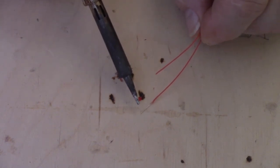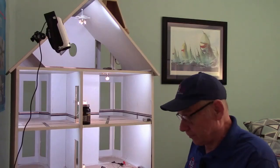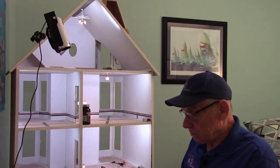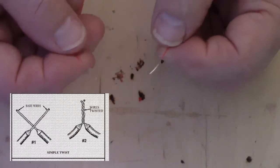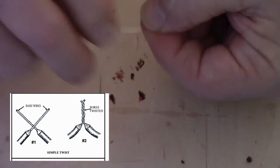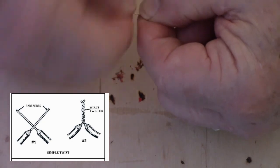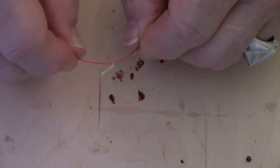You're taking the Kynar coating off that silver-plated copper wire, and you're going to get some residue onto the tip, so always go back and keep that tip clean. You want to make sure that your items going to be soldered are clean. The easiest way to join two wires is to put the two together at about a 45-degree angle and then twist them together. You do want to make sure that when soldering wires you have a solid mechanical connection of the two wires first, and that gives us a good connection right there.